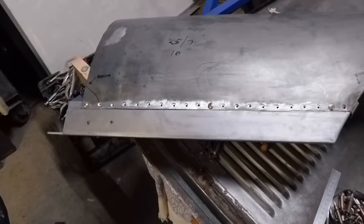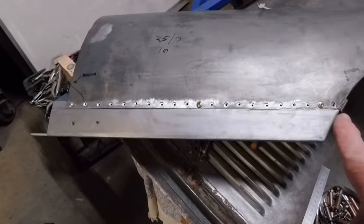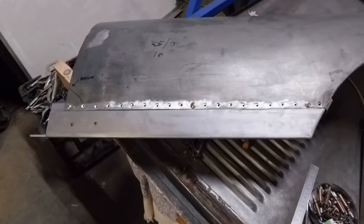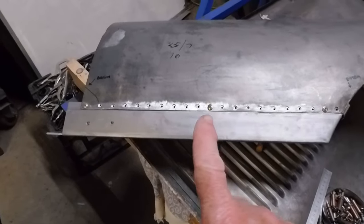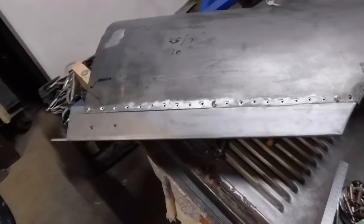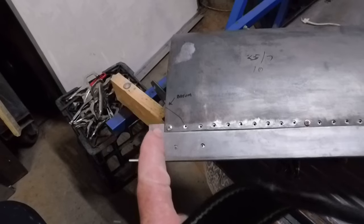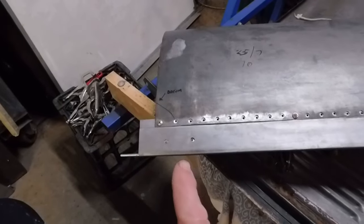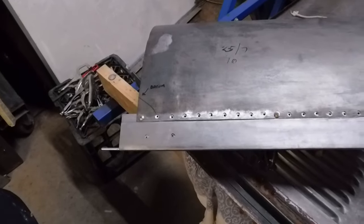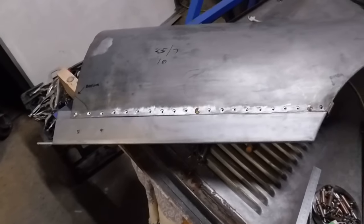The fitting is now almost complete. I've drilled all the plug weld holes and fitted the wire edge into the existing panel — that's lined up nicely. The shape is right on the outside. I've just got a couple of spots along the edge that I've got to trim off, and then I can screw that panel in completely. I might wait till I've welded it and then cut that end piece off and put the plug weld holes in the end here — that's welding it into the brace on the end of the wing. It's getting very close to being welded in place, so it'll be good to get that done.